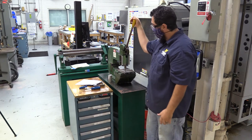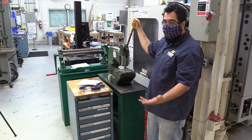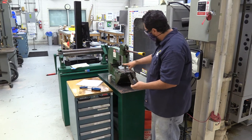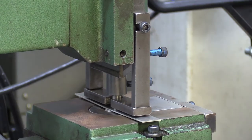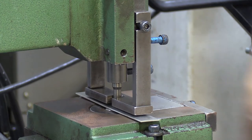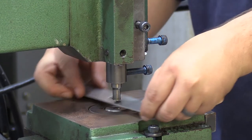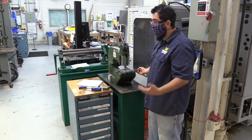I'm going to lower this slowly and I'm going to move my finger as it comes down so I don't pinch myself, but I haven't lost the accuracy of my placement. I'm going to put a decent amount of force because you're punching through metal. Don't punch yourself in the face or the shoulder or fall down. So you're going to pull down. Before you come up, we have to put the stripper on. The stripper is going to hang on these two points — I'm going to slide it underneath the set screw here and then hang it. When I do that, I lift up and the stripper stops the material from coming up and pulls your material off. If you don't do that, you will sit there and try and wiggle it and you can break the punch. Once we're done with that, I would take this off, line up my next punch, punch it, put the stripper back on. It is very hard to line up accurately with the stripper on the tool.